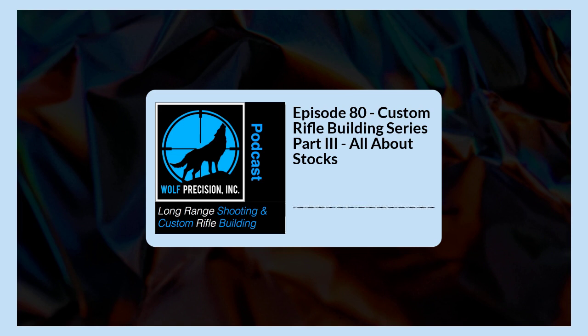For inlet channels, ours are for the BAT tactical action. The barrel channel we cut is a 338 Sendero contour — specifically a 338 Proof Sendero contour, with a 1.250-inch cylinder diameter and three inches long. If you tell McMillan it's for Wolf Precision rifles and their 338 inlet for the barrel channel, they'll get you fixed up straight away. That allows us to use both our carbon fiber barrels and our steel Krieger barrels in the same stock, since both mimic each other in contour.